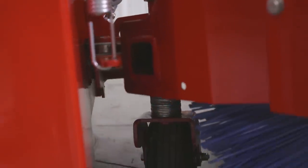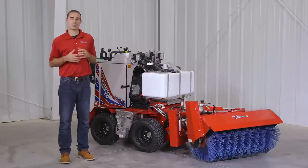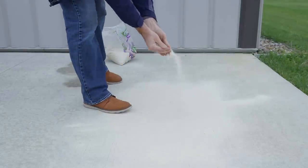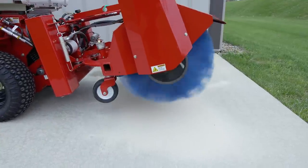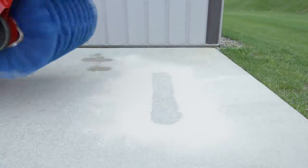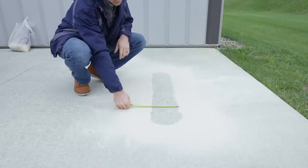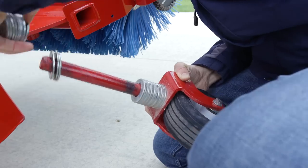Make sure that while you're operating the broom the caster wheels are adjusted within the recommended range. This is accomplished by making sure that the contact patch between the bristles and the ground measures between 2 and 4 inches. First, spread some sand or other loose material on a flat concrete surface. Make sure the broom is straight ahead and not angled. Turn the PTO on and pull the tractor above that loose material. Then set the broom down, put it into float position, and don't move forward or reverse. Pick the broom up, then back away and measure the patch that was cleared — it should measure between 2 and 4 inches: 4 inches for more aggressive, 2 inches for less aggressive. If it measures outside those parameters, adjust the gauge wheels on the broom and try it again.